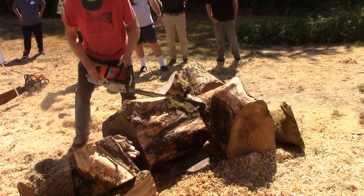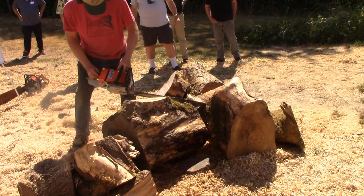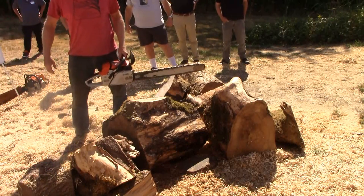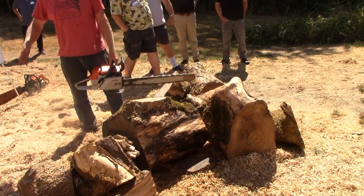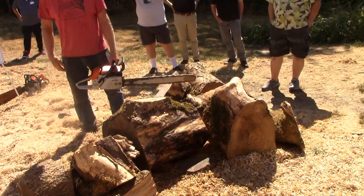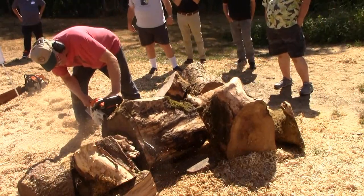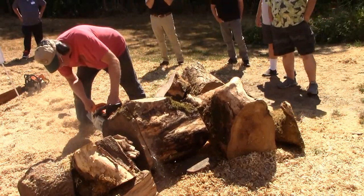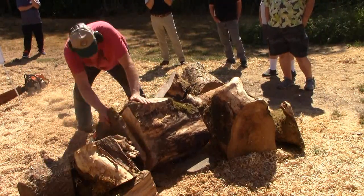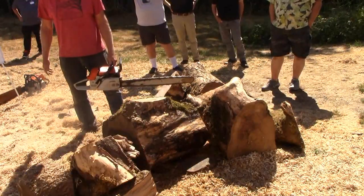Now you see why he prefers to cut vertical, because you can't maintain a flat surface when you're cutting horizontal. It always dishes a little bit. If you were picking a myrtle tree, I always say I want the gnarliest tree you got, but it sounds like you want the cleanest tree. I want the cleanest tree. With that said, I want crotches, I want burls, I want figured wood. If you're going to do utilitarian bowls, knots and bark inclusions are not your friend.